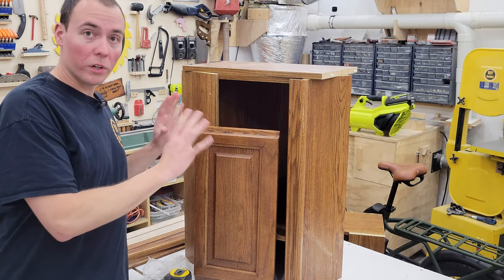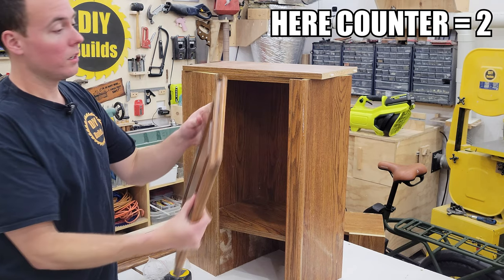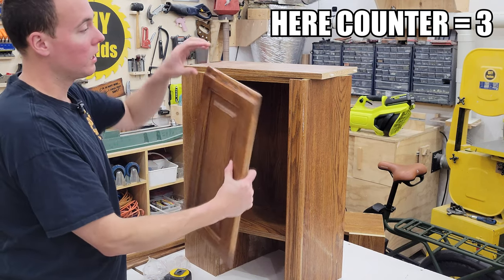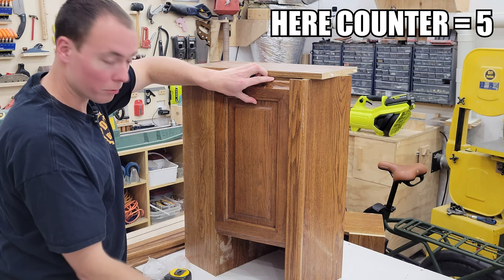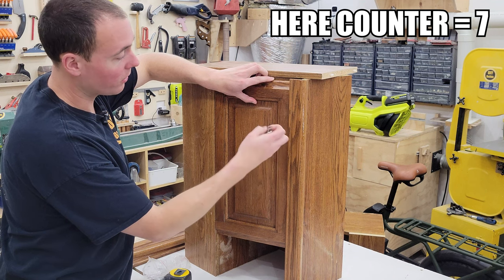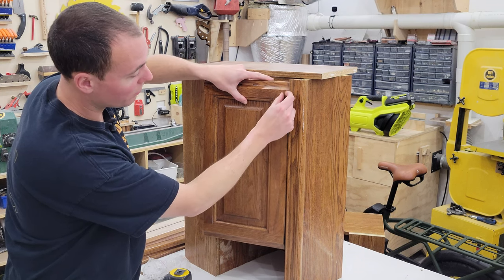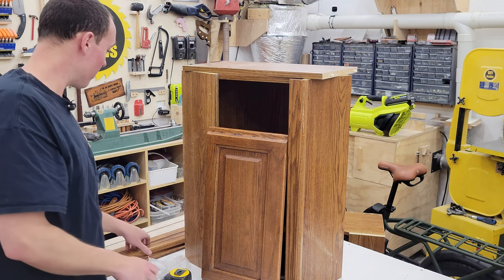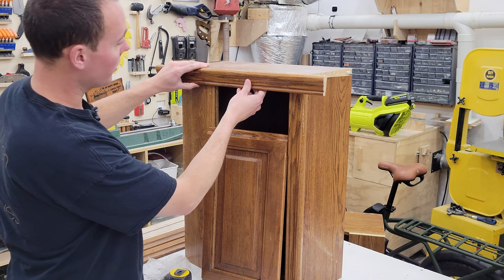Okay, so I've come up with a game plan. This old sliding door — you can see it's a little bit thicker on this side because it used to tuck back here. There's another groove which had a plastic piece that slid in it, and that's how the whole mechanism worked. What I want to do is put the door right here so it opens here and hinges from over here. We'll use these hinges, slide this piece in, and it'll attach to the back of this trim with the front screwing to here. Because of that, this is going to be a little too long, so we'll have to trim off the section that would normally be hidden behind the trim. We'll also be reinstalling the trim on this side to frame out the door, and we'll put some trim around the top as well.